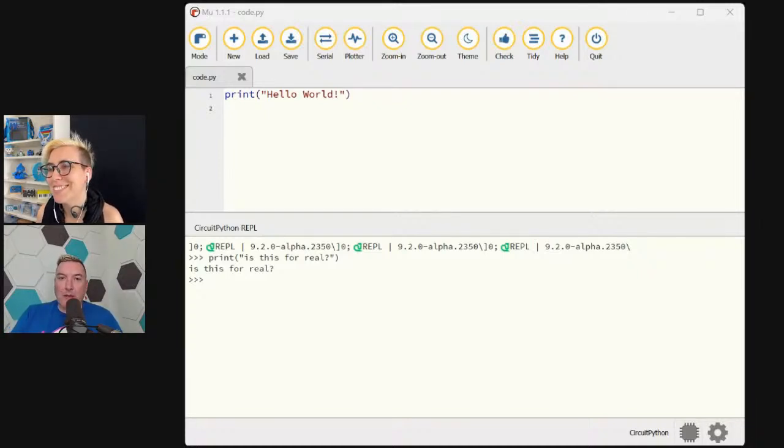I believe that CircuitPython is a fork of MicroPython, and it doesn't contribute back to MicroPython. So they have forked and bifurcated. And in my experience, CircuitPython obviously has fantastic support for Adafruit boards, and is really focused on the beginning maker. And MicroPython seems to have some of the features that I was looking for that I didn't find in CircuitPython. I remember when I was first playing with whichever Python it was, I think CircuitPython first, I was like, oh, cool, how do I do interrupts? And the answer was, there's no interrupts. There's a different way. There's async, where you can do it in CircuitPython, but we don't have interrupts right now. Maybe that's changed since I tried it several years ago. Whereas MicroPython did have interrupts, so they're quite different.